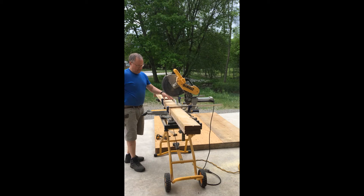That's how I went about cutting all of the studs to the proper length. The next thing I need to do — because the plan calls for 2x3s — is deal with the fact that they sent us 2x6s, which are 5.5 inches wide. I'm going to take those to the table saw and cut them down the middle, getting two studs out of each piece of 2x6.